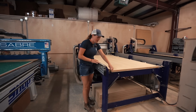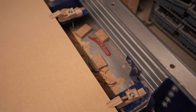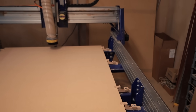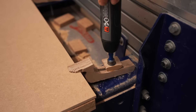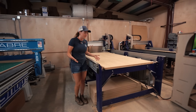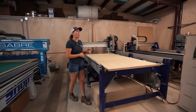Jacob has come up with these very savvy, unique hold-downs for these machines. We use an electric screwdriver to go through and tighten down on every single one. It has a built-in torque setting that won't allow you to over-tighten, and it drastically speeds up this process. Then we use two quick squeeze clamps for the middle of each end. Whenever we use thicker material, we don't have to use as many hold-downs as this quarter-inch requires.